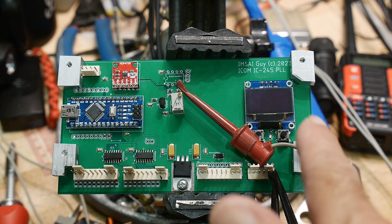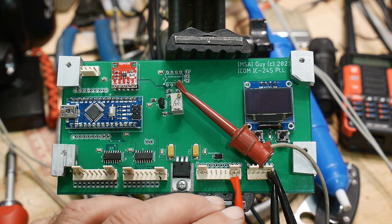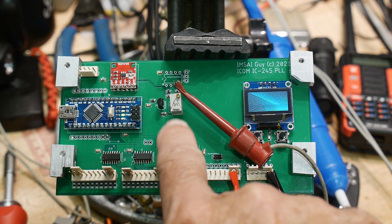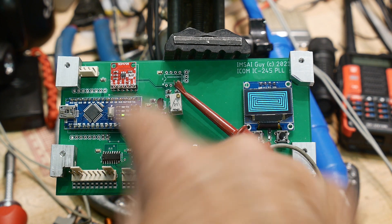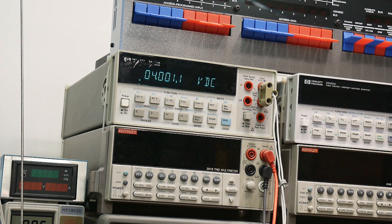I have my Arduino, and I put the display on here. I've put just these two items on and tested it — connecting the power, you can see the little display is working. I've got the Adafruit demo program running, so that's working great. I decided to load a 5k resistor — I had it in series with a 10k resistor, but my brain was upside down. It has to be a 2k resistor, so I put in a 2k resistor, and I'm able to dial that in.